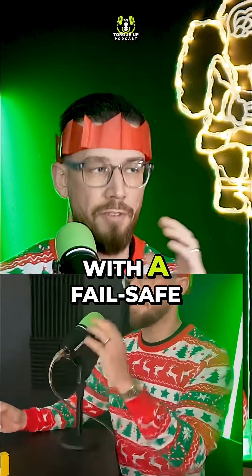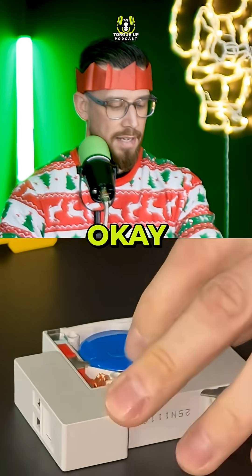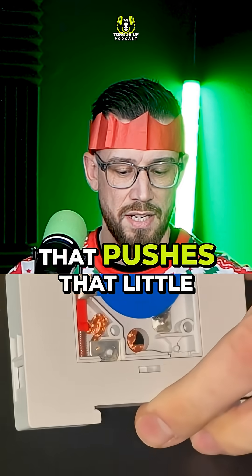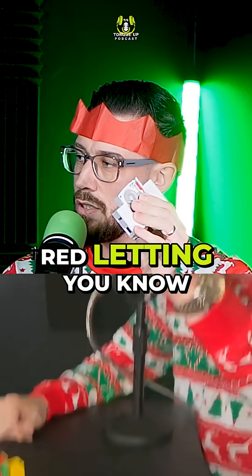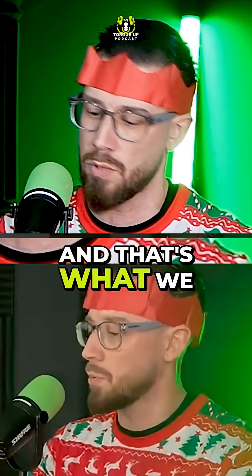They have to come with a fail safe. That fail safe is a solder joint. So when this melts out here, this burns out, this will melt. When that melts, it removes itself and pushes that little green flag forward. Your indicator goes red, letting you know this SPD is dead. So there is no overcurrent protection within that — that is a fail safe solder joint.